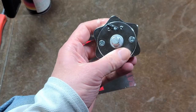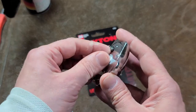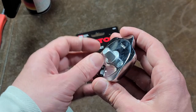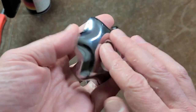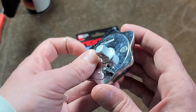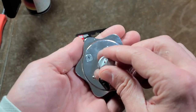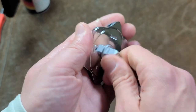So I decided to give this 3/8 palm ratchet a shot because it was only $8. It is made in Taiwan, surprisingly enough. It isn't the greatest of quality, but what do you expect for $8? The exterior chrome plating and finishes actually don't look too bad. It's only a 24 tooth and it just uses a basic swing-pawl ratchet design with regular Phillips head fasteners. The anvil's reasonably tight for what it is, but it's actually pretty stiff — they didn't put any lube in it.